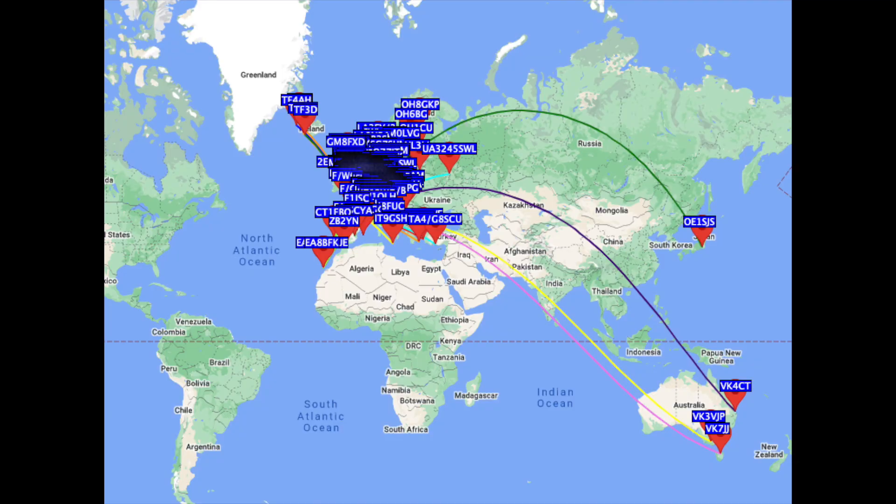Mine's at the top end of that range, and it's sturdy, hard-wearing, and will probably last a lifetime. You need some antenna wire for the radiating element — lots of choice from simple hook-up flex, wire wrap wire, all kinds of different cables. Having assembled the antenna, you'll get one that can be used for the main ham bands above 40 metres. It's cut as a half-wave for 40 metres — so 40, 20, 15, and 10 metres. I've also run this on 17 metres with no real difficulties, and one of the plots I'll show you later is the 17 metre radiation plot. It worked extremely well on 17 metres, which is not a band it's designed for.